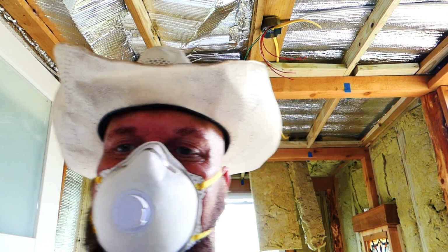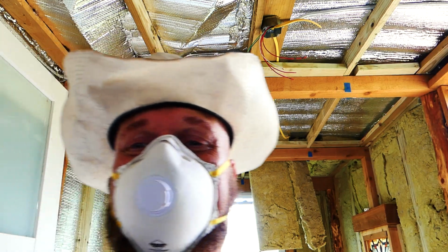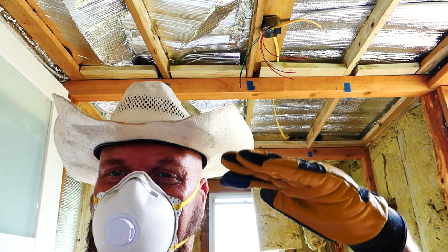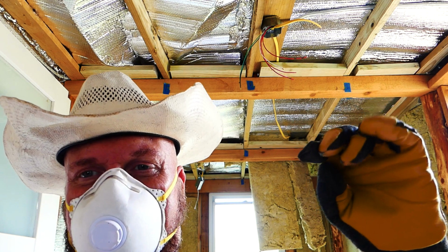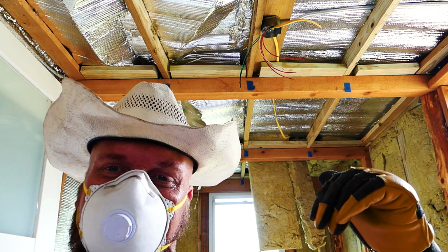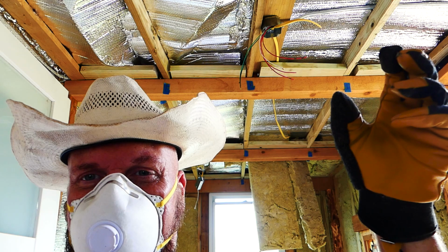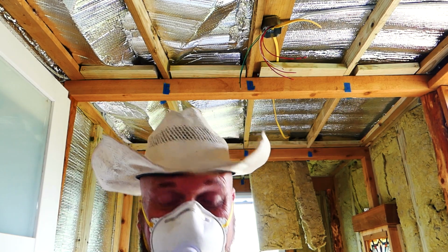All right, so I did have to mess around a little bit in that insulation to get those lights. I was just hoping I could slip it in. I couldn't. Also, I'm going to be pouring a concrete roof over these rafter ties, so I want to make sure that the Romex doesn't ever get pinched. There are corrugations where I could run the Romex, and I'm doing that, and then I staple it according to specs so it won't move. And then I'm leaving a little bit of slack at the very end so I can move the electric box around just ever so slightly. I know that I'm close enough. When I drill it, I want to be able to reach up, find it, and plug in the light and be done with it. I don't want a big deal over it.